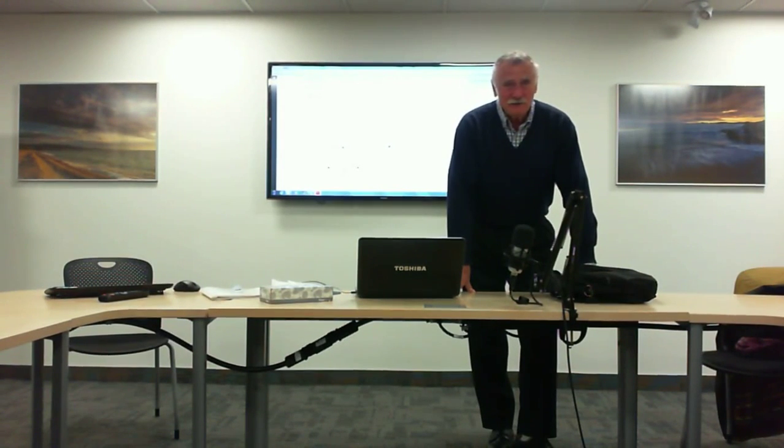What is an autodyne? We have an oscillator, which is an active component used as an amplifier. This amplifier amplifies even noise. From its output, the large signal is fed back to the input in a way to reinforce the phase of the signal at the input. That's how we create an oscillator. So the autodyne is an oscillator that's running pretty well on the frequency you desire to pick up. You want to pick up 3.5 megahertz, your autodyne oscillator is running on 3.5 megahertz.